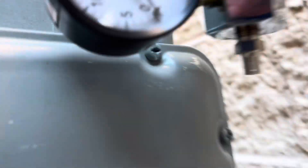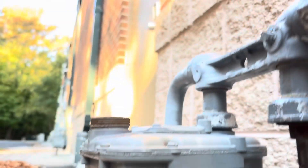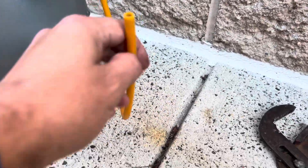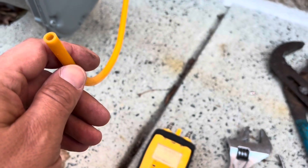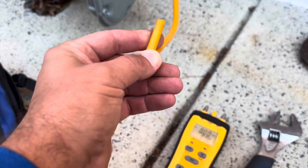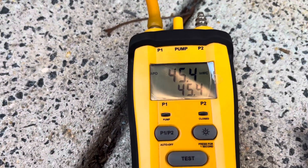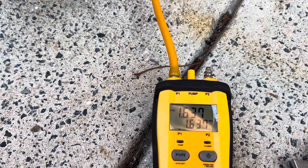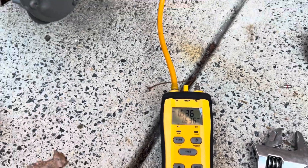For the low pressure test, I'm going to pull the valve core and put my manometer on there. With the valve core removed, I hook up a hose and simply blow into it to get a few inches of water column, then kink the hose off and hook it up to my manometer. We ended up with 45 inches of water column — about 1.6 psi — so I had a lot of air. I'm going to let some of that out.